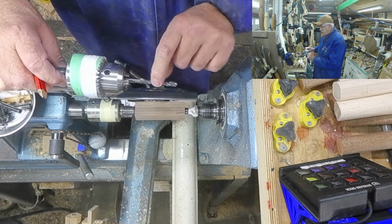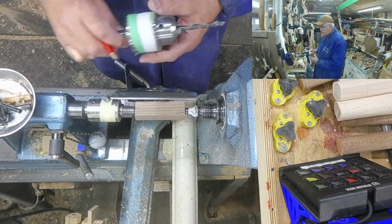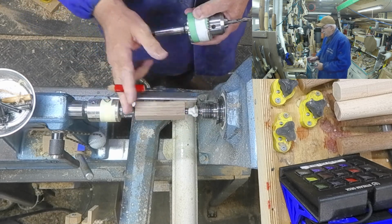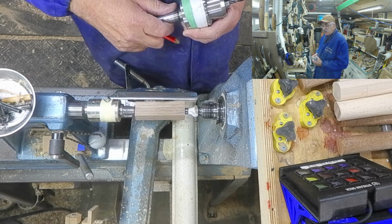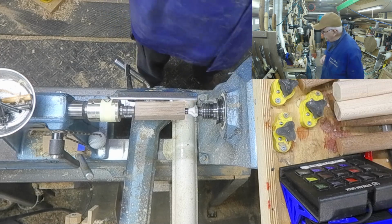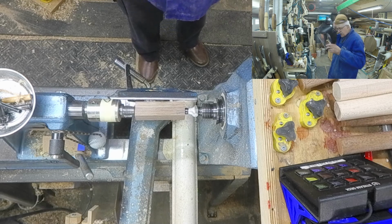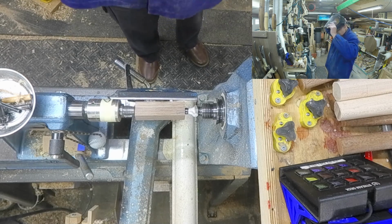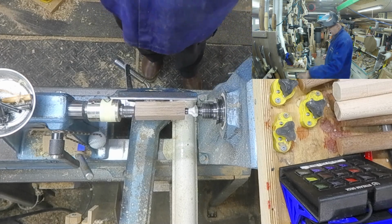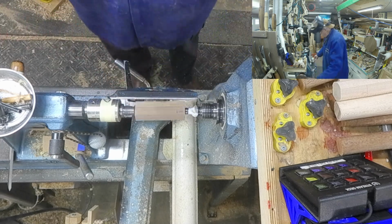What I'm hoping to do is make the beads real simple. I can turn lots of these little sticks and make the tenon on them so they'll all fit in a chuck. Because it's only sticking out three or four inches, I should be able to turn the beads relatively quickly. So without further ado, I'll grab my face shield and we'll get to doing some turning. Again, this should be really nice skew practice because basically it's just spindle turning. Raise this up a little bit.